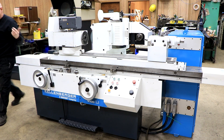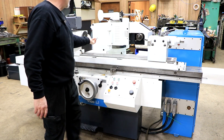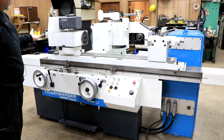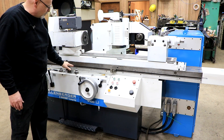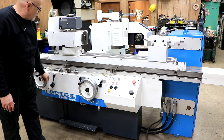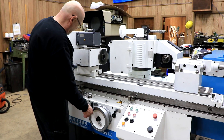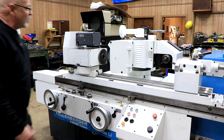It has three points: this point, when it's completely turned around so that we have this ID spindle over here, and when it's in the front. So now you put the clamp on — you can put the other clamp on. You have to remember that this is also going to come forward, so you want to make sure you don't have your table on. If your table is shut off — that's this valve here. You're going to have your infeed mode in the hand so that you can work this by hand. This is not an operation you're going to do automatically — this is a tool room machine that can do this kind of work, but it takes somebody actually doing this, and then when they're positive everything is okay, they can send the head back.